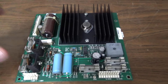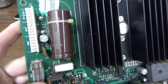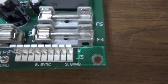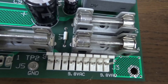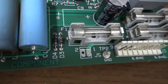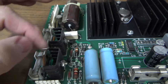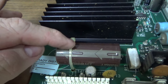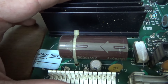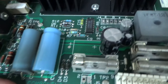Here is the power supply. It has a transformer in the bottom of the machine that creates various AC voltages, and then it comes up here and is turned into other voltages by this power supply. The 9.8 volt I believe is the general illumination. This section here is running the voltages for the displays. This capacitor here and this one are creating the 5 volt - this capacitor is basically a filter capacitor. These smaller caps you sometimes have problems with too.